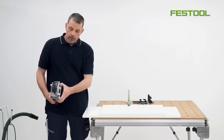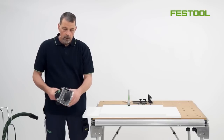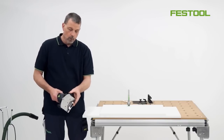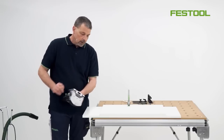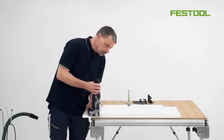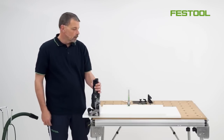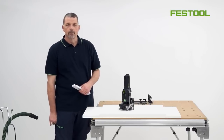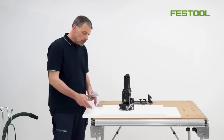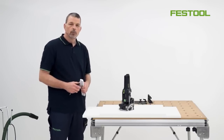With the 6 by 40 millimeter cutter fitted to the machine, we can bring the fence up so now we can work in the vertical position. The big advantage of working with these stops is it will give me an equal spacing where I start the cuts for positioning dominoes. Working with the domino jointer also means I can reduce the amount of marking out that's needed. With any cabinet, I want to make sure that my dominoes are positioned equally to ensure good support on the joint.